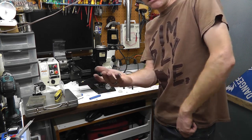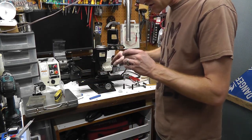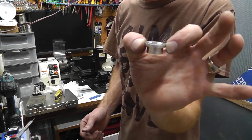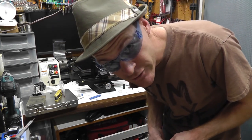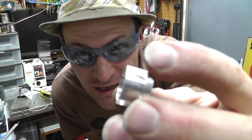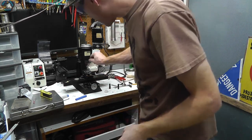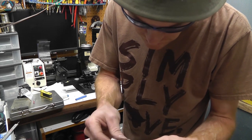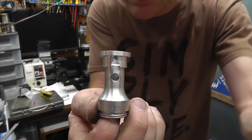So instead of cutting it with that I cut it with this. After I got done I realized if I had just used a micro end mill I could have slowly chiseled that out. But I just didn't want to take the chance because I've had bad luck — the only clamping pressure you get is right on the outside of this guy and I was afraid of bending this. Now I gotta get the rest of these pieces. One more thing I could do — I did cut that notch out. I did use that big end mill and it actually worked. I was a little scared but I clamped it sideways so that's why I was fine. Now when I put this on here it will line up with that.